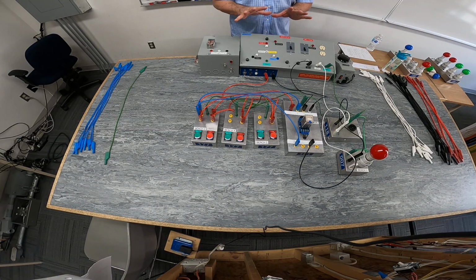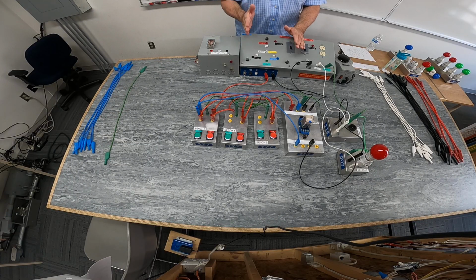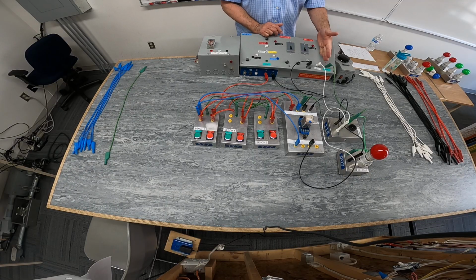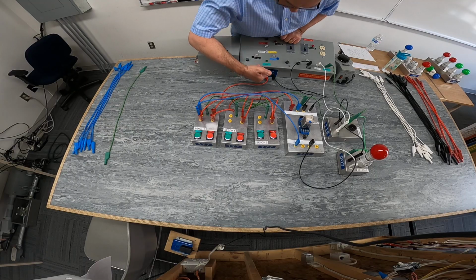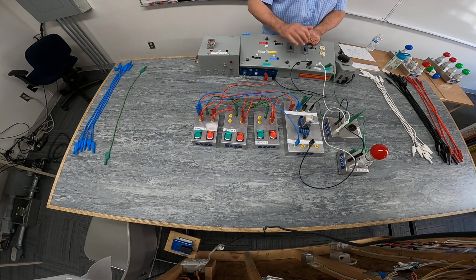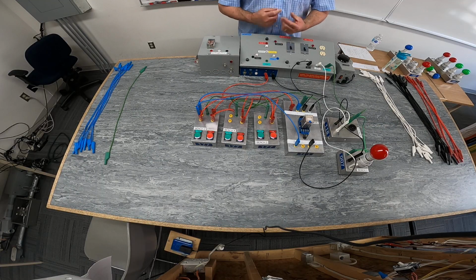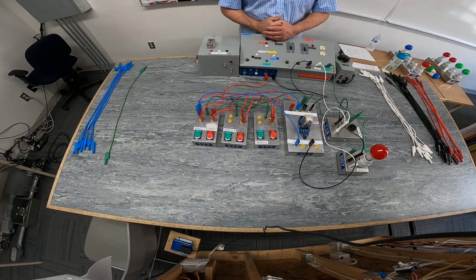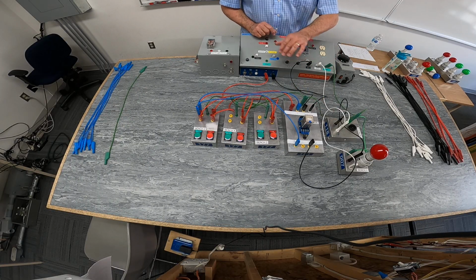Also, the last thing I want to say is ensure that you have all of your schematic drawings accurately drawn. Make sure you have your line voltage for your 120 volt side on the left, your neutral identified on the right, and also you have your low voltage. We have positive on the left, negative on the right. Make sure you show both your 24 and your 120 volt, your dual voltages that you are using here, and make sure all the connections are labeled for your relay, your coil.